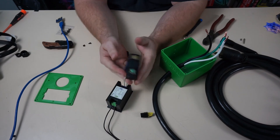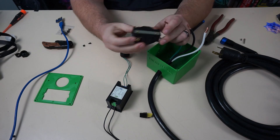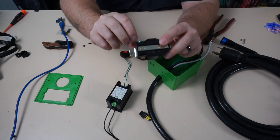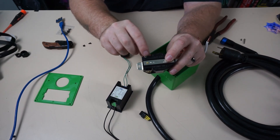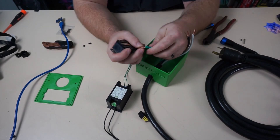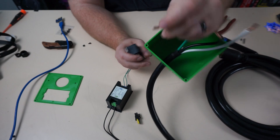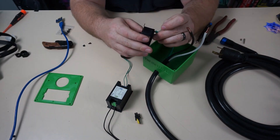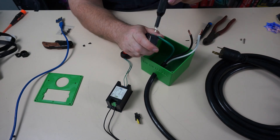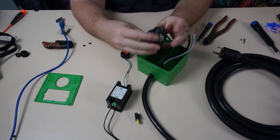The next thing we need to do is get our L630 plug. We're going to take our green wire, and if you look under here you can see there's a U-shaped plate where this screw is. You really want to just slip it underneath and it'll hold it down really good. You can kind of see where it was hooked up before on the other meter and it was flattened. I find that if you hold it upside down it makes the plate stay down and makes it much easier to get the wire in there. Make sure it's really tight because you don't want this thing coming out.